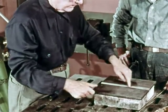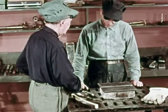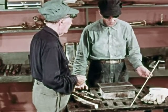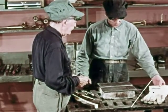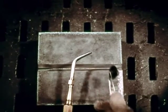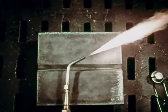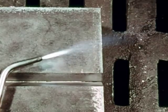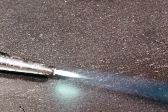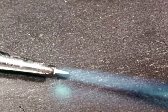The weld area has been thoroughly cleaned, including the top of the plates about an inch back from the V. This time we'll use an Oxwell flux-coated rod — it's more convenient, you don't have to dip this rod in the flux can. For this job we'll need a larger tip on the blowpipe and a welding rod one size larger. Braze welding is always done at the same temperature, but thicker metal requires a greater volume of heat. Don't forget to add oxygen to the neutral flame — the inner cone will be slightly shorter.